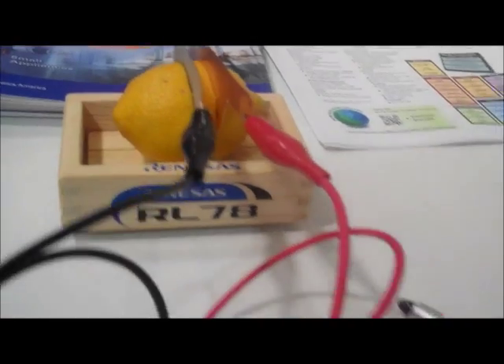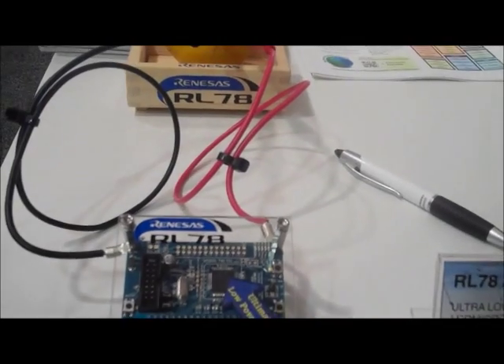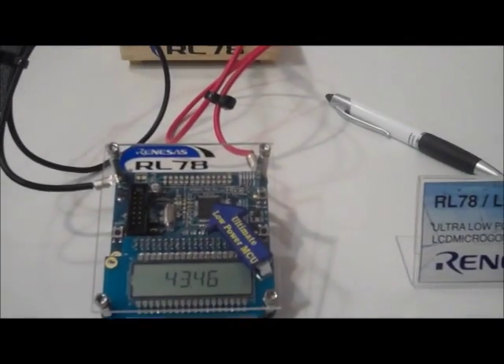What's unique about the L12 is the voltage drive methodology. The methodologies used by competitors — names you might have heard of — are the resistive method and the voltage boost method. What the L12 offers is the capacitive split method, which actually allows the L12 to operate as low as 0.12 microamps to drive the LCD. Now that truly is an impressive number.